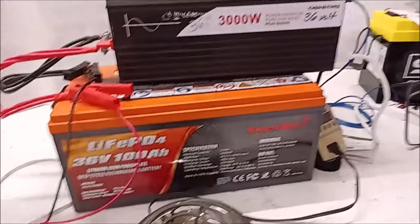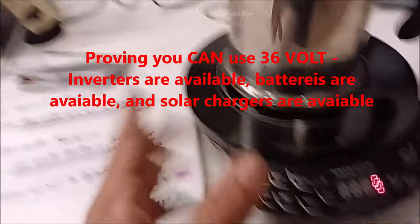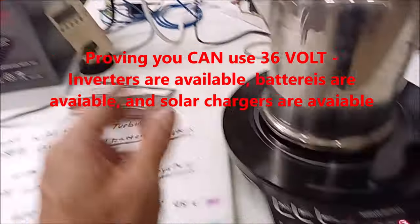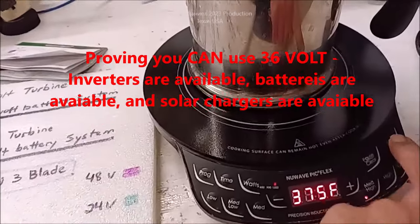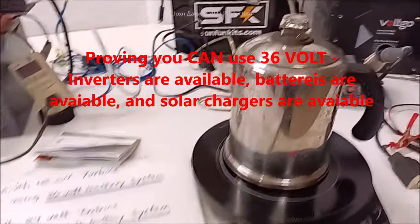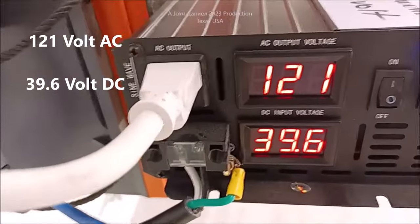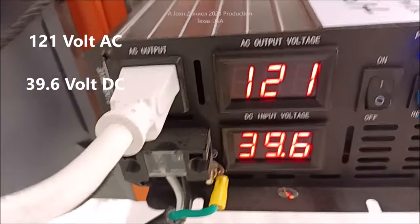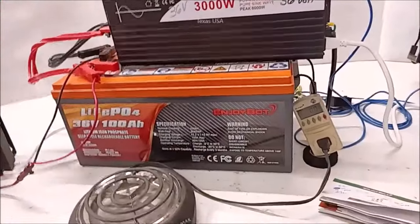I have been cycling this battery and we're going to get into that - both of us have kept notes. This is about wind turbines but we're going to be running this during the video so you'll get to see why we're showing you the 36-volt battery. Going ahead and putting it on medium-high and hitting start to perk Kira's tea. It's been running and it's sitting at 121 volts AC, 39.6 volts DC, so the battery is at about 89-90 percent capacity right now.